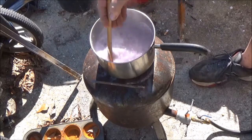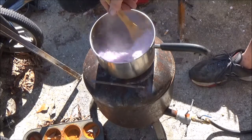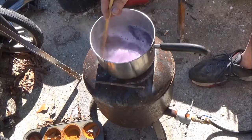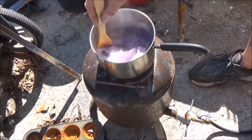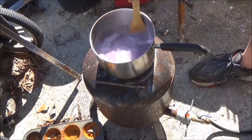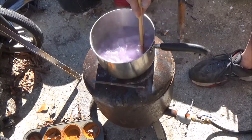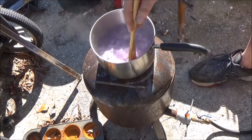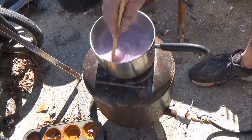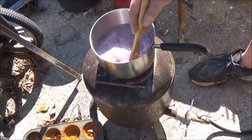If you take this and mix it with sand like I said, make your mold for whatever you're working on, you can inject it with CO2 or just let it sit for a few days until it hardens — it'll soak up CO2 out of the atmosphere. Then you can demold it, take out what you made the mold of, put the mold back together, and pour your cast nice and hard. Seems to be thickening up a little bit. I'll be back once it thickens up.